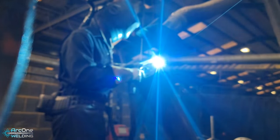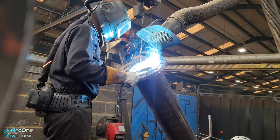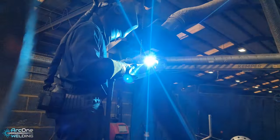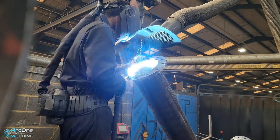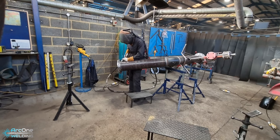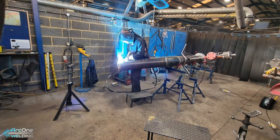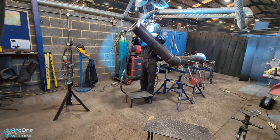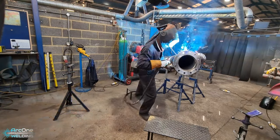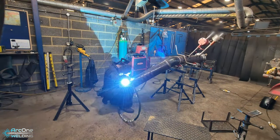Now the long part — flanges. I hate flanges, but this here will be pulse welded. The beauty of pulse is it allows your welds to stay in position, so you can weld overhead and get nice penetration characteristics as well as no spatter, as long as the settings are correct and the pipe is clean. You can weld overhead, upside down, to the side, vertical up — all sorts — as long as your power isn't so crazy that it drips down. Welding at a 45-degree angle, you could say I'm stoving it, but I'm angling the torch to try to push the molten metal back up and stop it dripping all the way down with gravity. This video is wrapping up shortly — just two welds, two flanges.